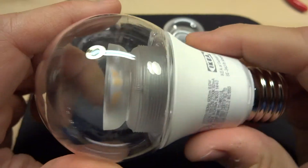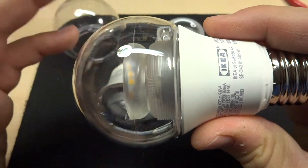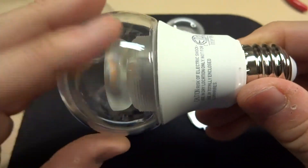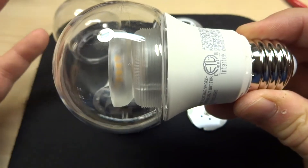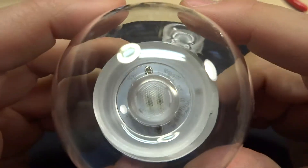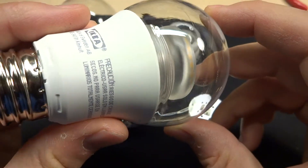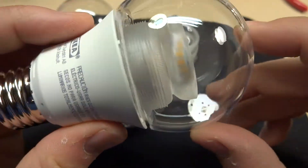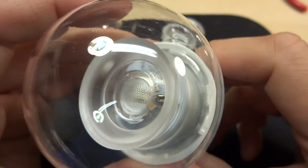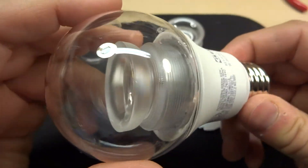I love LED bulbs with a clear dome because a diffused one actually reduces light output. You can buy these in both 600 lumens frosted and clear versions. The downside of the clear is you might get a little bit of a pattern cast, but this bulb has a circuit board at the bottom with a clear light guide that allows light to shine at extreme angles. You can see the LED chips even at steep angles — it's not perfect but gives pretty good, bright light.